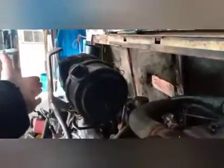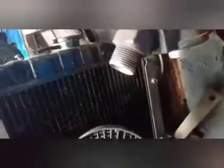And then what we're going to do here is spin this around so that the air filter housing's here, and then we're going to get a hose, run down here, and then pop it here, and then pop it up, and then have the pre-cleaner, which is here. A little pre-cleaner. I don't even know if it's really a pre-cleaner, to be fair. Just a little cleaner sitting in here. You might even have it sitting that way. Doesn't really matter, because by the looks of it, it's not really a pre-cleaner. So it's sort of pointless, isn't it? So that is another thing that we're aiming to do, and with a bit of 2-inch water pump hose, we should be able to do it.